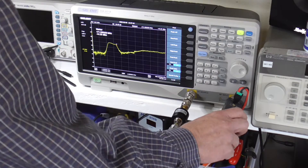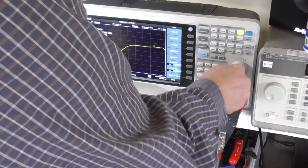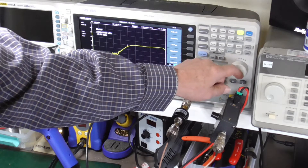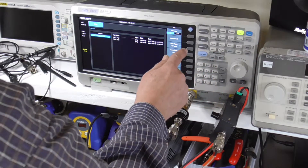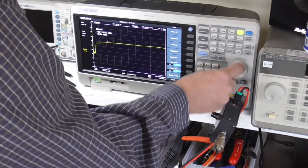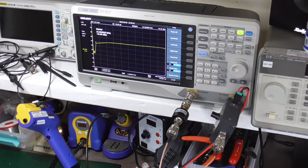This happens in the other filter positions too. With the 225 to 1500 MHz filter selected — I won't go out higher in frequency since cable attenuation would make it confusing to separate cable effects from device behavior. That filter appears to start around 247 MHz versus the specified 225 MHz, which is pretty good. Switching to the 24 MHz to 2.1 GHz position, it starts around 24-25 MHz — that's working pretty well.